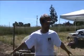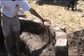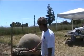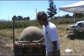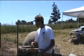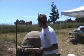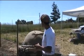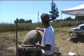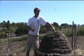So now we've done this so far. We put up these bricks here, starting making the bench. With the oven, we finished doing the bricks on the floor, and then made a sand mold. We used just broken chunks of concrete and some broken adobe bricks, and then we put sand over it, a kind of wet sand, and made a nice form. So we're just about done with our thermal mass layer.